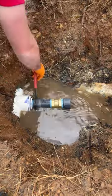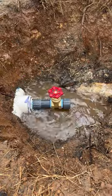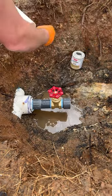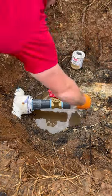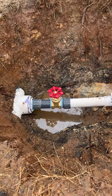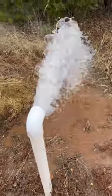I was planning on doing this repair a little differently until I dug everything up and realized I wouldn't be able to turn the water off, which is why that schedule 40 nipple was cut and has a male adapter glued onto it. Personally, I would have gone with a ball valve over this gate valve, however the water provider specifically requested that another gate valve be installed. It was raining while we did this repair, but once everything dries up, the water provider is going to paint that PVC.